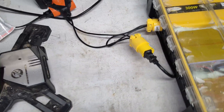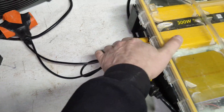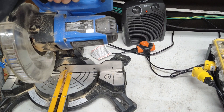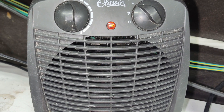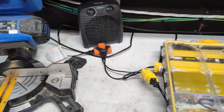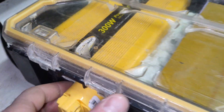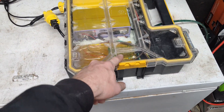Got the inverter on with the GFCI outlet. Plugging this in - running through the heater - let's see if it'll run. It's running! Not with a lot of power, but you can see the heater turns on when I turn it on. Let's try 1500 watts just for fun. Running it... and I believe we overloaded - yes, you can see a red light on the inverter inside. We did in fact overload. I'm going to reset the inverter - to spin that fast, that was not 300 watts, that was quite a bit more. I want to check the temperature of my BMS as well.